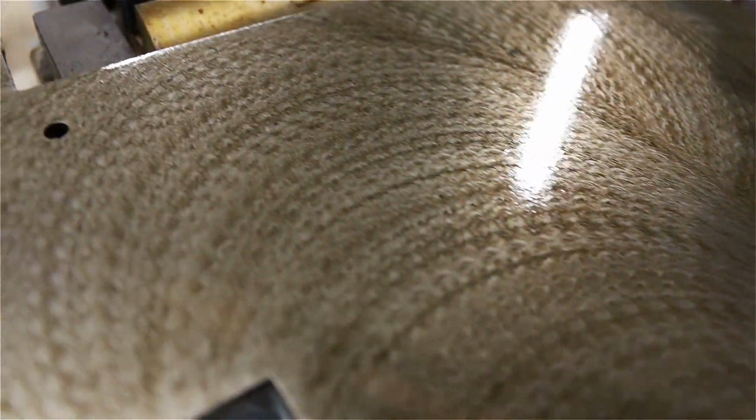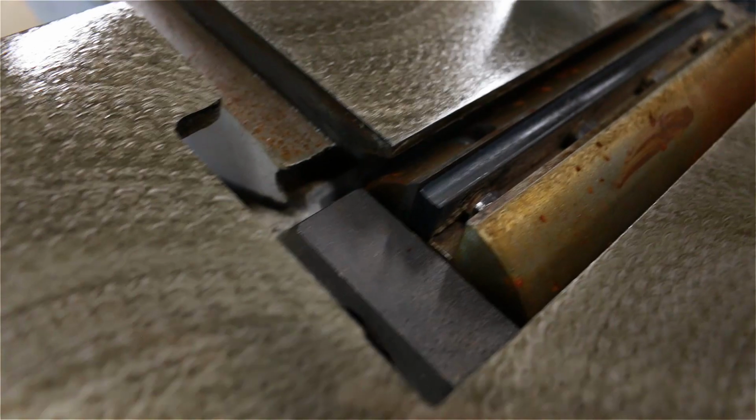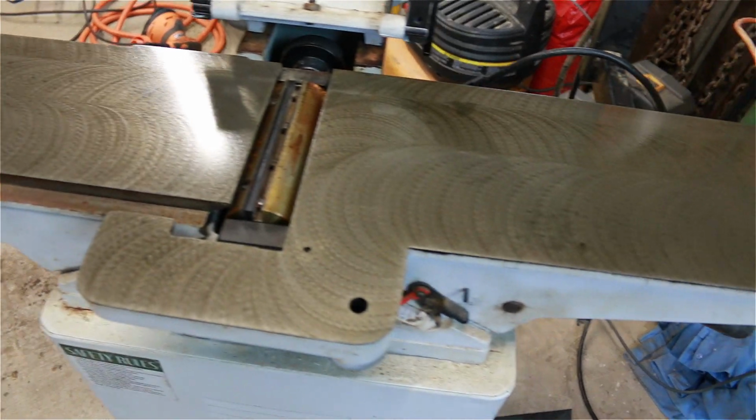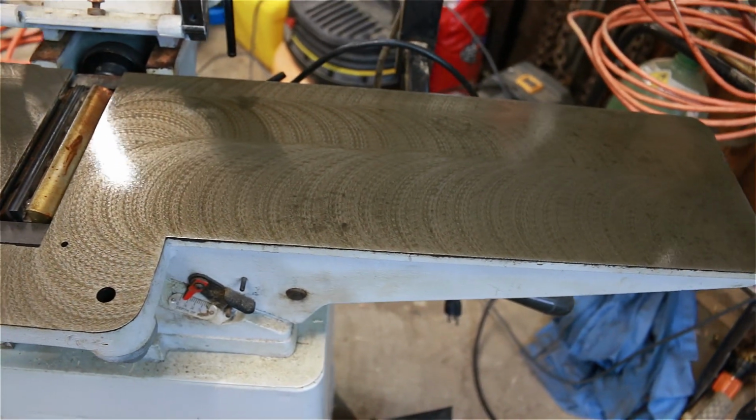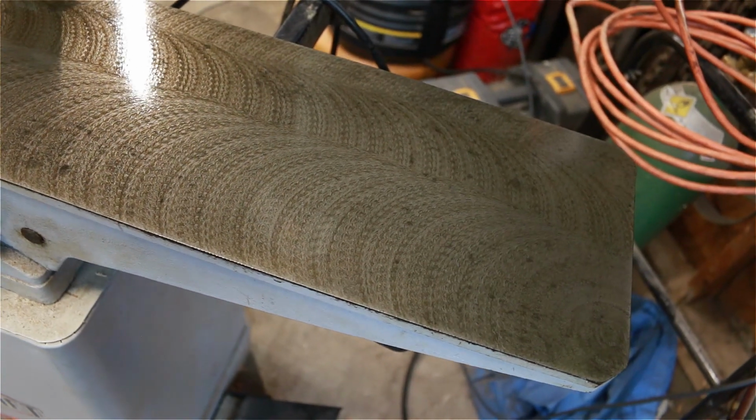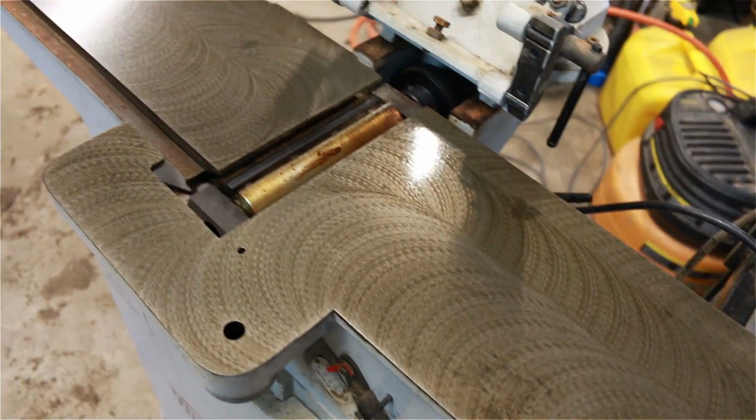You'll start to notice that it gets darker as you sand and buff it with that Scotch-Brite pad. You'll get these beautiful little swirls in it, and the longer you go, the more it gets into the metal and just buffs out all of that nastiness. So make sure that you're spending a good bit of time with the Scotch-Brite, a lot more so than with the sandpaper, because this is where it gets really nice and smooth and buffs that out.